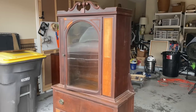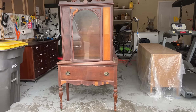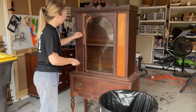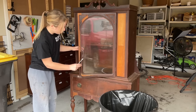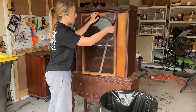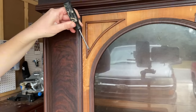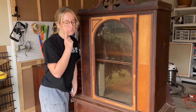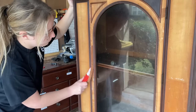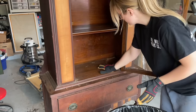It is just a stunner. Normally I would just wood-fill any small veneer repairs, but this thing had a lot of really bad moisture damage trapped underneath the veneer, and this is why most of it was pulling up super easily. While it would have been awesome to restore this burl wood veneer, it just wasn't an option because I was missing a quarter of the front panel, so I said my goodbyes and carried on. The house this furniture was left in had some pretty bad roof damage, which is why there's so much moisture trapped underneath the veneer.